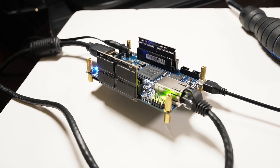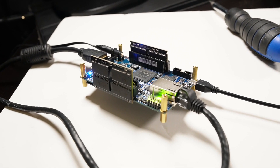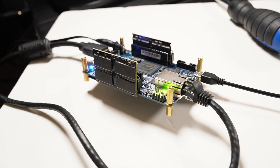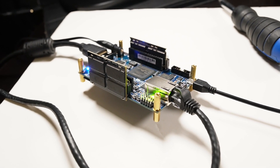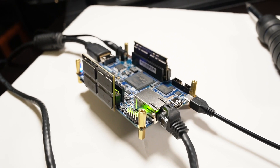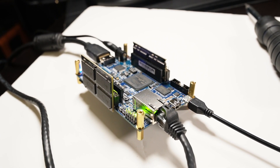I removed the analog I/O board from my DE10 Nano and inserted a memory chip I have from another DE10 Nano. This is how the setup looks for me. The developer does want the core to work with only one SDRAM chip, but as it is now you will need two.